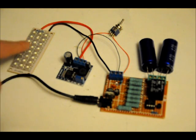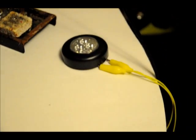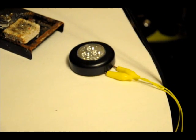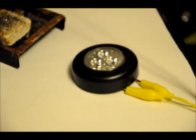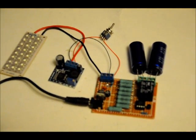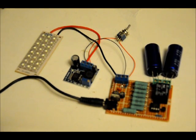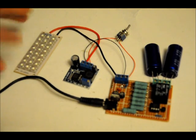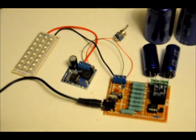You don't have to use the booster. You don't have to use this LED bank. You can actually use — and I'll show you an example — a one-dollar LED flashlight from the dollar store. You can hook it up directly on the capacitor leads if you want; you don't need the booster. However, the booster circuit I've employed here can make for an extremely bright flashlight. Ideally, if you were going to boost to 12 volts, you'd want some bigger capacitors. But I've got terminal blocks here so you can add some huge capacitors — for instance, 400-farad capacitors.